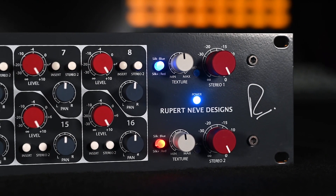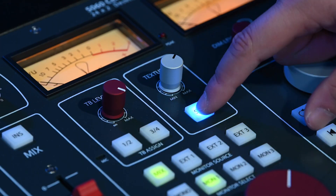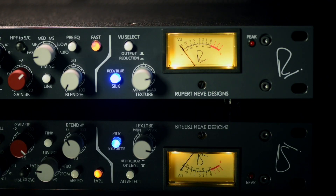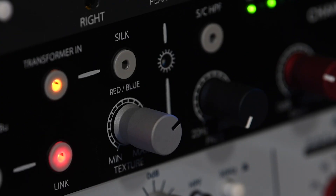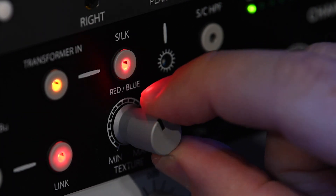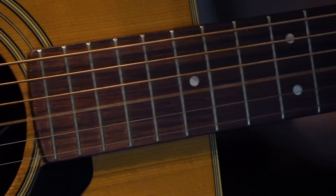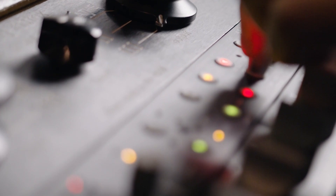What we do with the Red and the Blue in Silk is frequency contouring of where those harmonics are allowed to come out. If you want more low-frequency harmonic content to enhance the low-frequency characteristics, Blue Silk reduces the feedback in the low-frequency area of the signal spectrum and allows more harmonic content in the lower frequencies. Similarly, in Red Silk, filtering is applied that pulls the feedback out in the mid-range areas and allows the harmonic content to enhance that frequency spectrum.